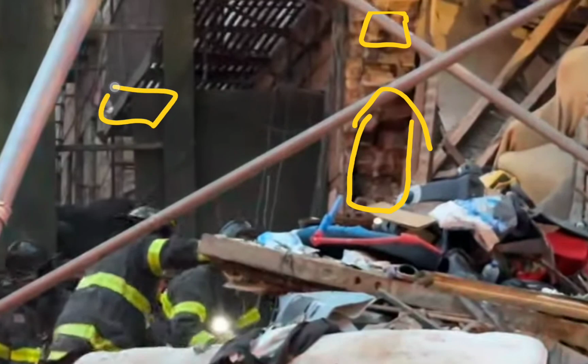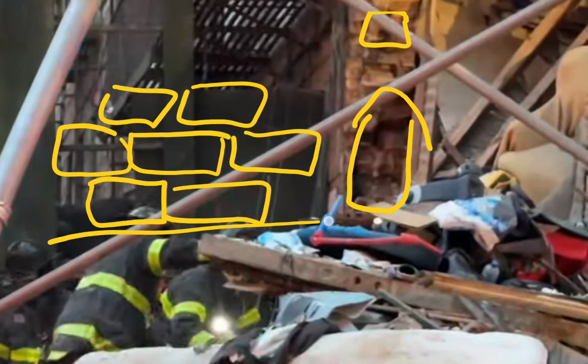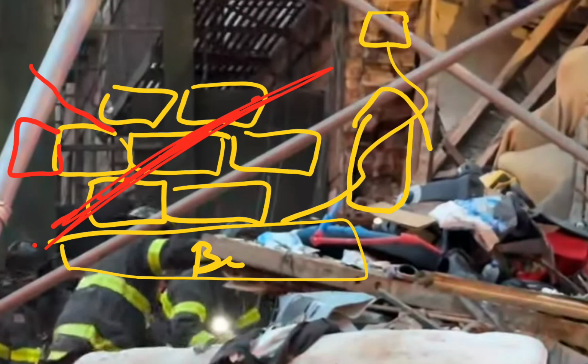I want you to keep in mind that when you put together a brick wall, sitting locked in over years, you'd be surprised what you can remove, like this beam, for example, and these bricks will stay in place because they found a load path. It's both in tension and like a corbel back to compression also. So there are load paths that can really be redundant.